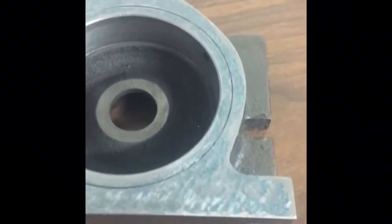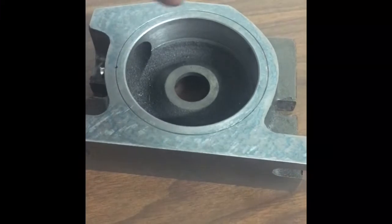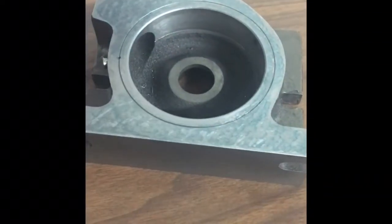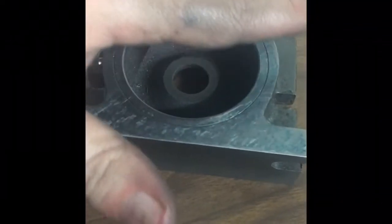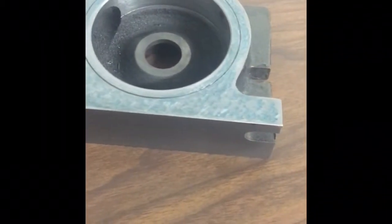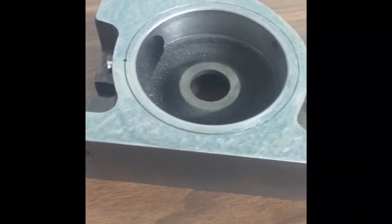There is some good patterns developing. I really like how this is coming in over here. My major concern is the area around the oil groove, obviously. I'm definitely going to bring this in. When I measure it, it's actually within about two to four tenths, depending on how I'm checking it. So I'm pretty happy with it for now.